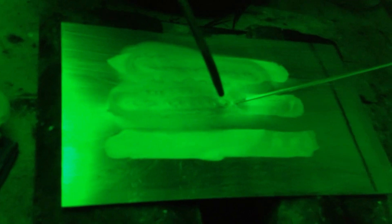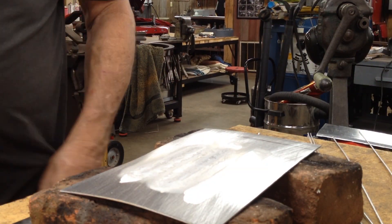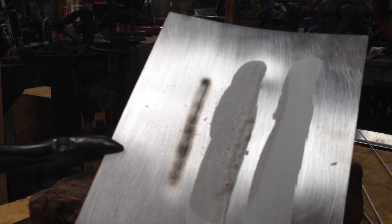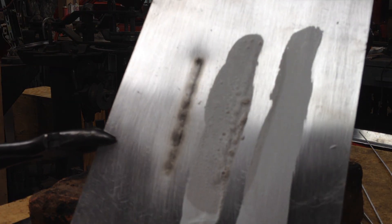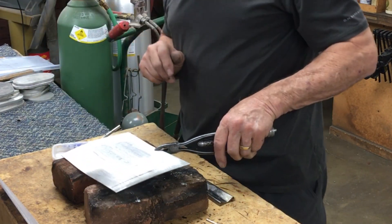Let's start to see it get shiny. Still a little bit slow, but I don't know if that lens will let you see the burn-off envelope around, but it's a real soft burn-off. You can just see the edges of the burn-off flame are orange. Now you can see the weld bead is in there, but it's fully covered by flux. So when we wash that off, it will be a nice clean, evenly floated-out bead. So that's just a quick example of running a bead.